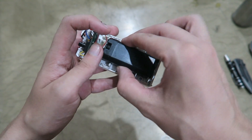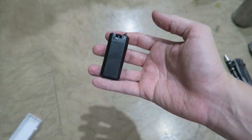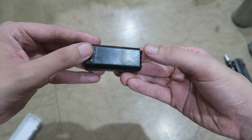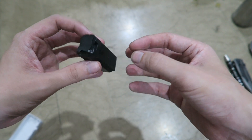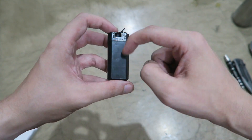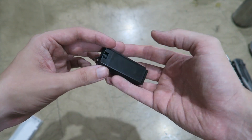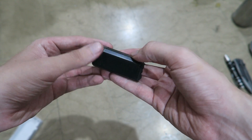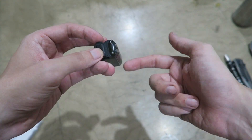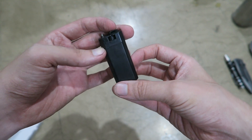I'm still like 99% sure this is a lead acid battery, just because of the design and the weight — it's very, very heavy. When we search for a 4-volt lead acid battery online, the ones they're selling look identical to this. There's a very small possibility they could have hidden a lithium battery inside and just used this as a case, but it wouldn't explain the weight, and I can't imagine why they'd ever do that. Plus there's no circuitry on the light to handle a lithium battery. But let's crack this thing open and be 125 million percent sure.